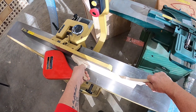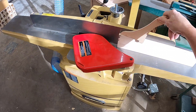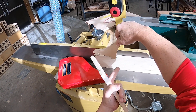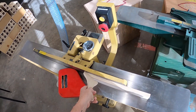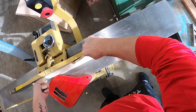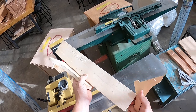One push stick in front, one in back. Notice how I'm hooking the lip over the wood on the back, and on the front part I'm using the nose of the push stick and the lip to push down with the nose and in to the fence. You want equal pressure with the left hand and the right hand, keeping it tight to the fence and to the bed, and we take it through nice and slow. If you go slow you get smaller mill marks; if you go fast you get big mill marks and a weaker joint.